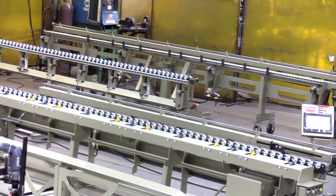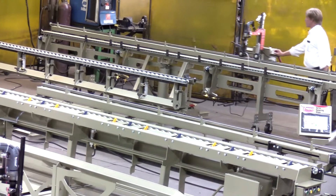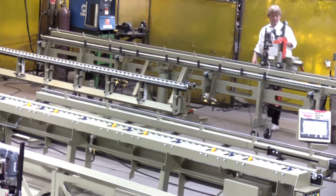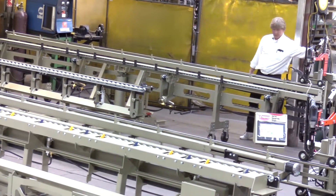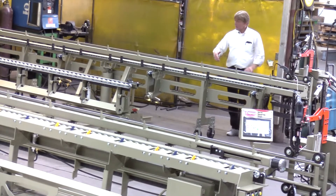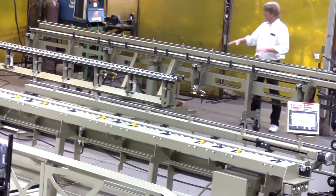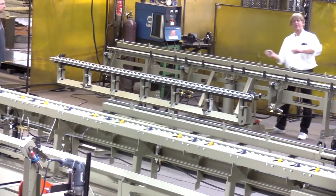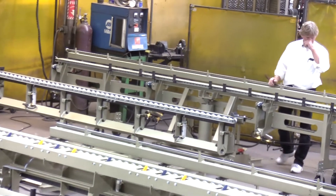If you're just doing balloon walls, you're going to take your screw dolly, run right along, and nail everything off. You've got the same dolly rail system and a park station on the far end. Once this thing pops down, it's always out of the way. You've also got a center support skate wheel as well as on the rest of the table. So when your balloon wall gets done, we're going to pop it up with the skate wheel rolls so you guys can get it off the table and keep production rolling.